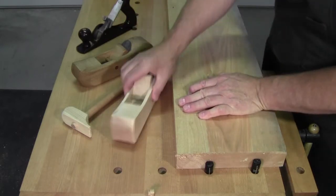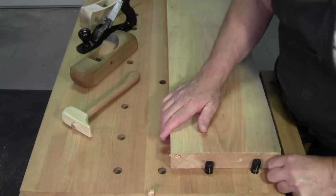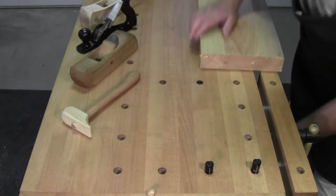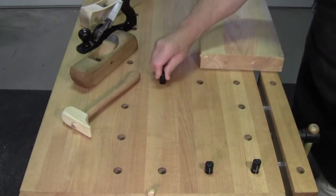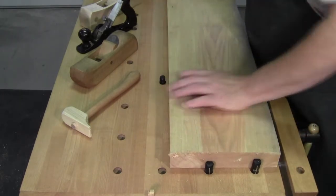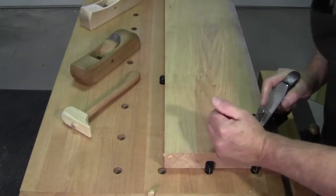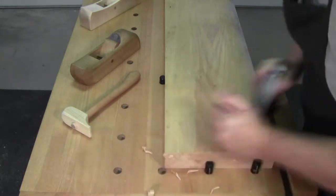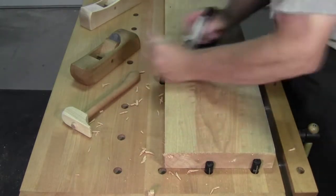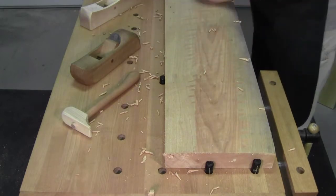So here's a situation where we've got a large concavity over the top here. So this would be a situation where you can use the scrub plane a little more on a diagonal across the middle. See, we're just hitting the top. It's getting flatter back here.